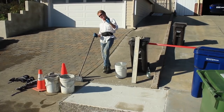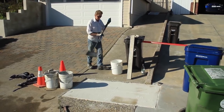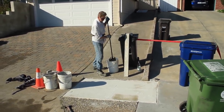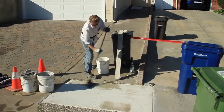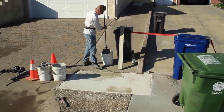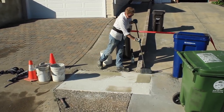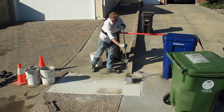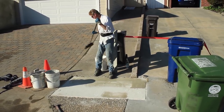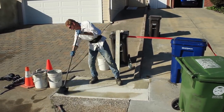We're showing you how to do it. At the end of the day, this is dried for a long time, so I need to wet it. Since I don't have a water hose over here, I'm just going to hit it with this broom and dip it in water because the next coat is poly bond mixed with sand. Are you supposed to do that? No. But I'm just showing you tricks of the trade that we used to do and I still do.